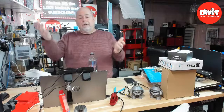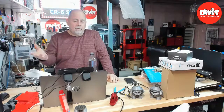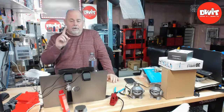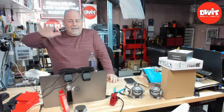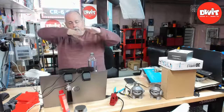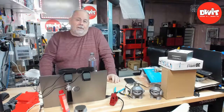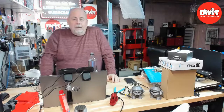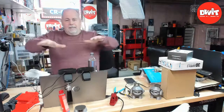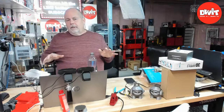Wow. And you know, it's funny because, as I said, on one of my Ender 3 V2s at my office, the one printer, it can be cold as ice and the prints are still sticking. I have to get that scraper, get a corner under, and then get right under it. So it'd be interesting to see if I could turn the heat bed off after the first layer and see if it sticks. I think the Ender glass or the Creality glass beds seem to be inconsistent. As I say, I have 3 of them and they all behave differently.